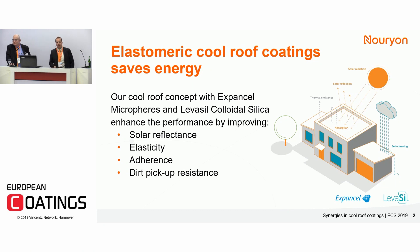A few words about elastomeric coatings. They are very often called waterproofing coatings and are applied on roofs to protect the substrate from water leakage and high temperatures from the sun. What happens when a roof heats up during the day and cools off at night is that the substrate moves with the increasing heat and contracts in the cold, and the coating needs to move and deform with the substrate without forming cracks. Very often these waterproofing coatings are formulated as cool roof coatings to reduce the temperature of the roof, giving higher comfort inside the building, a lower coating surface temperature, and a longer lifespan of the coating.